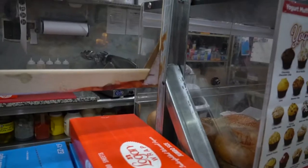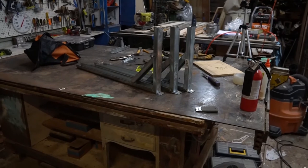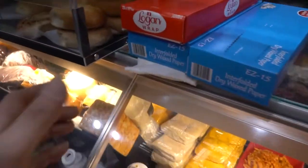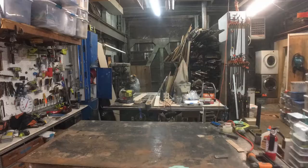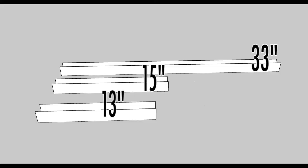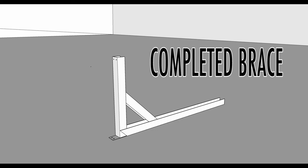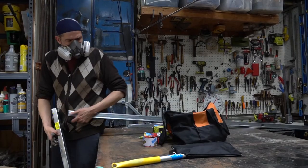Part 3: Steel Track Braces, also known as Johnny's. These are the steel track braces and we are looking at three finished pieces. We are going to make one of them together now. These holes are for mounting to the bottom of the panels or taping down the braces to counters if you are doing an elevated panel. These holes are for mounting to the panel's sides and joining two panels together. I'm using track so that you can still add studs if need be — you can easily make the height taller or the base longer with studs because they fit right in there and you can just screw them in.